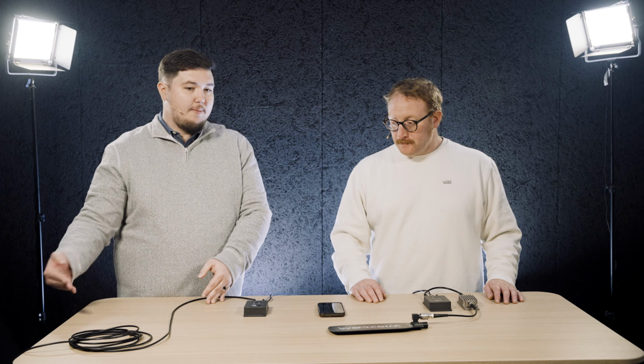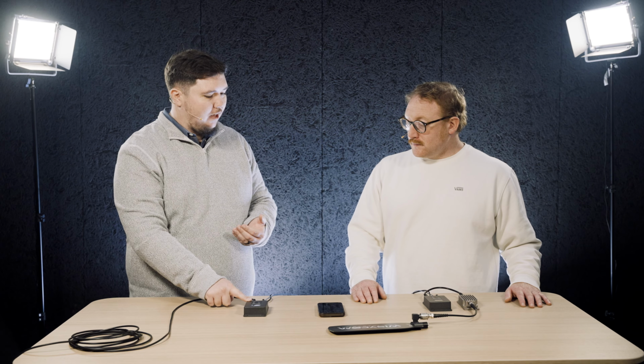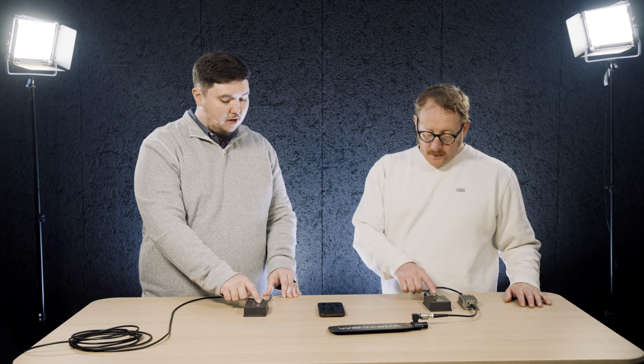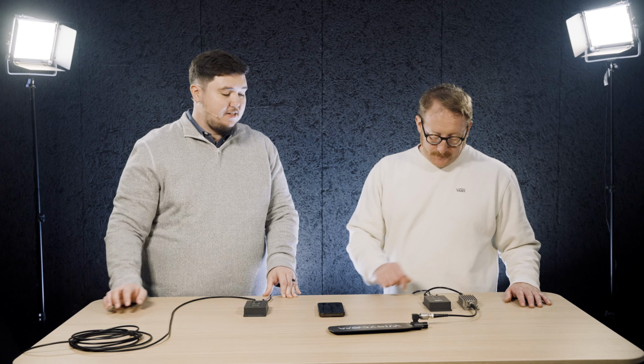So next we get into talking about managing your RF levels. Managing it for microphones is different than this because when you come out of your MTK 982, you'll see there are two connectors for each channel. On the 982, there's a BNC and an SMA. The BNC would plug into your normal CSI 16, your local zone. Your SMA is a 0 dBm reference copy. The reason we utilize this is you can convert out of the SMA and go straight into the BFL. To do that, you can use our recently updated app, or on the BFL itself, go into your menu, RF menu, and settings, and make sure mode is set to IFB. What this does is change what the RF input level is working for, making sure all levels in the gain staging are matched across.